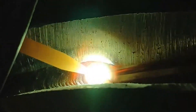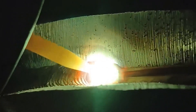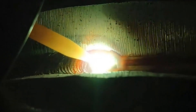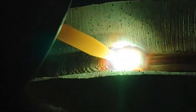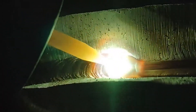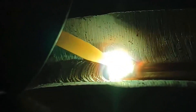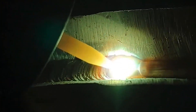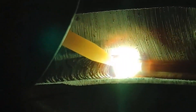The circular rod movement method involves making continuous circular motions at the end of the electrode while moving forward. There are two types: positive circle and oblique circle. The positive loop method is suitable for welding flat welds of thicker weldments, allowing the molten metal to reach a high enough temperature so that oxygen, nitrogen, and other dissolved gases can precipitate and facilitate slag floating. The oblique ring method is applicable to T-shaped and butt horizontal welding in flat and inclined positions, helping to control the molten metal to avoid dripping and to aid weld formation.